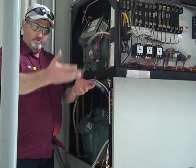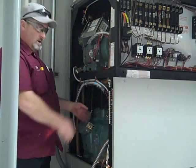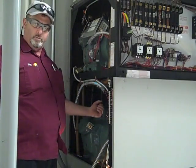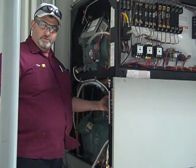Once that's done, we have a new compressor. We're going to put that in place and hook up the piping back to the new compressor. We also have a liquid-line filter dryer that we'll have to change. We'll pull the old one out with the torch because it's brazed joints, then put the new one in place.